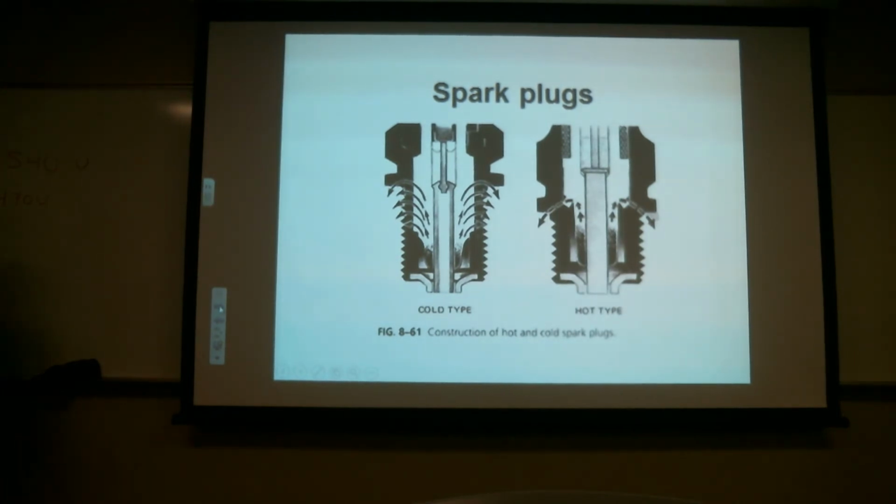But the contact area is what's distributing the heat, right? That's what you're saying. Yeah, the ceramic area. So the longer this whole contact area is, the more it's dispersing outward. If the spark plug's shorter, it's not able to disperse as much heat. It's not contacting the cylinder head as much. So if I have longer threads in there, it's obviously touching more surface area.